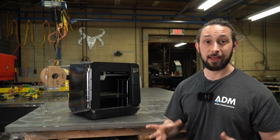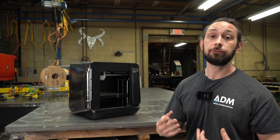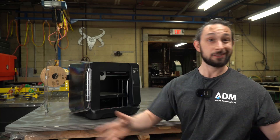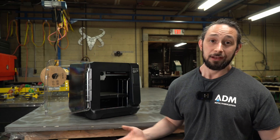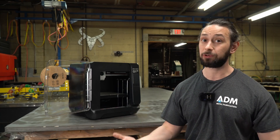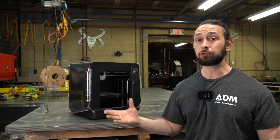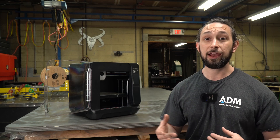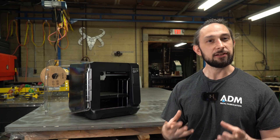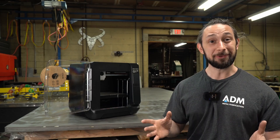I'm very excited to try that. I've been just printing with PLA Plus for now, but that was definitely a selling point for me on this printer. I want to experiment with more of those materials because I'm in a fabrication environment. Using engineering materials has some application, specifically for things like drill fixtures, welding fixtures, locators, go-no-go gauges. Those are all really practical applications for 3D printing, and being able to print them out of harder, more rugged material that isn't going to break or get cracked would be really good.